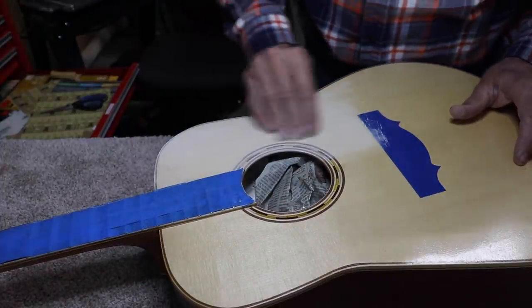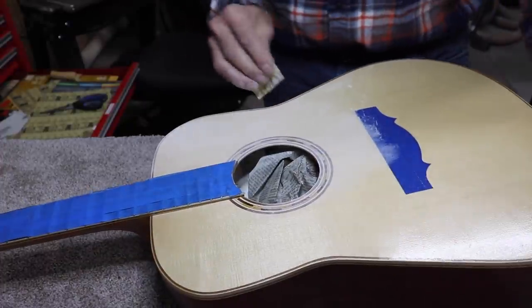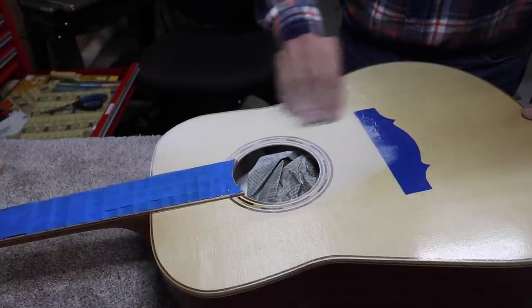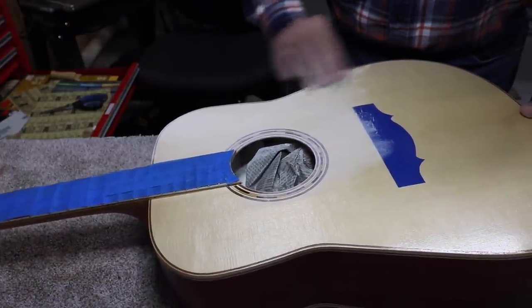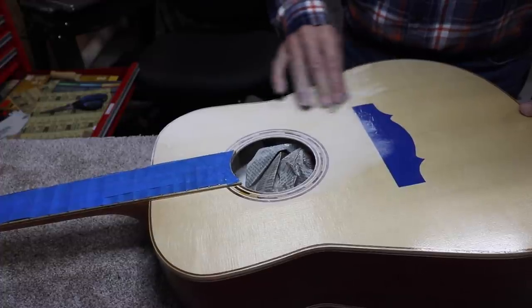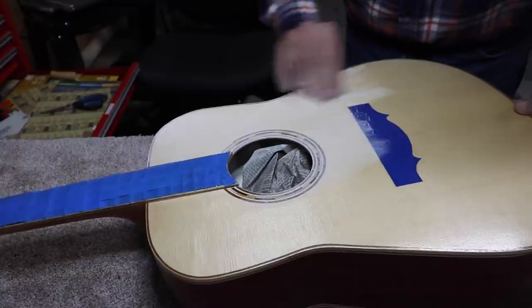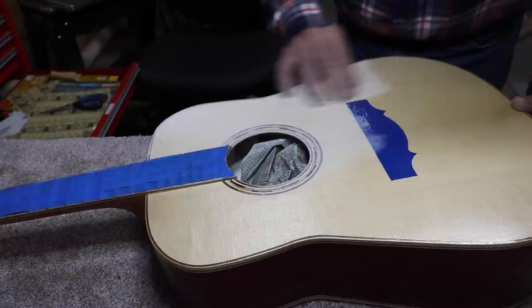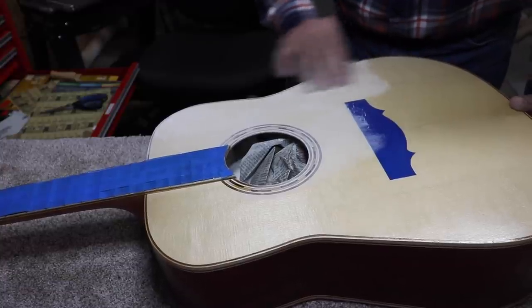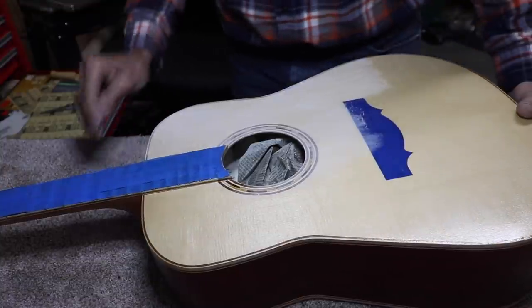The 220 seems to be doing just a perfect job right at the moment. There's been about half a dozen coats of the varnish applied at this point. But it goes on so thin that it's hard to explain how thin we're putting it on there — and therefore, when you say a half a dozen coats, it's probably equal to about two regular coats, if that.